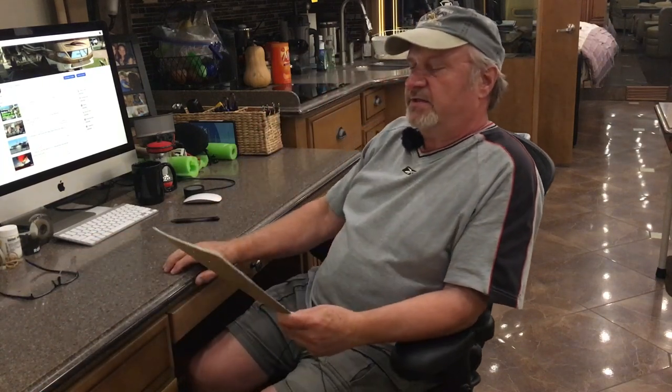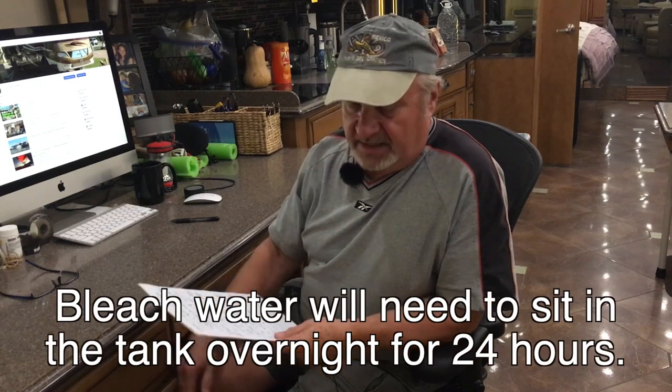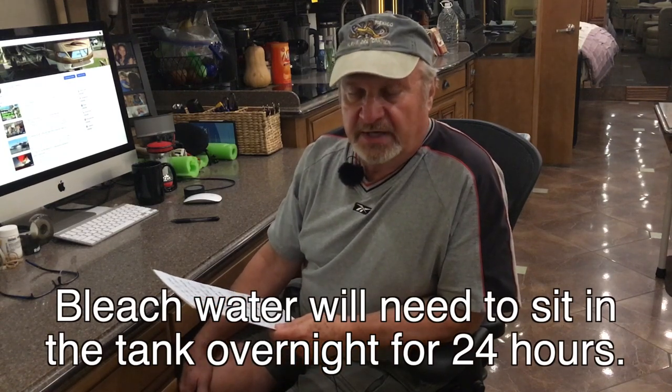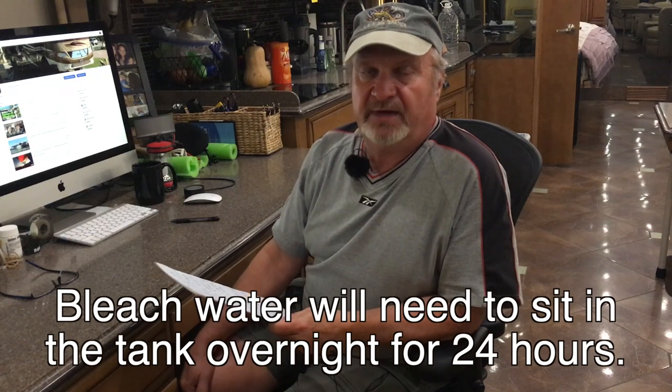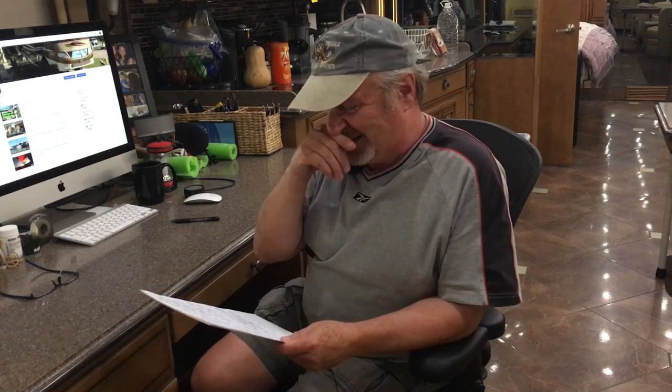When I was done filling the tanks, I ended up putting the filters back in each of the canisters of the Clearsource system. And I also hooked up the water softener and I turned my city pressure on, because in fact, I'm going to be letting the bleach water kind of sit in the 105 gallon tank to cook away and do its magic, sanitizing the system.